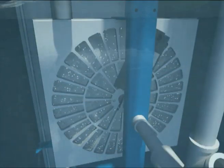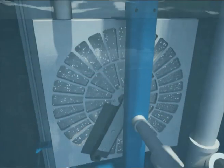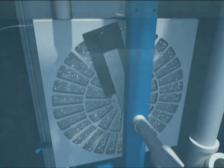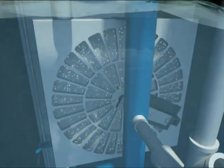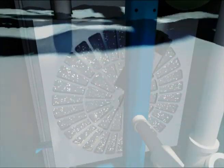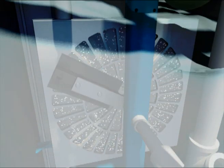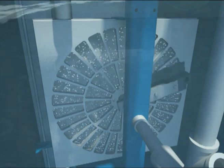When the level reaches a predefined point, the automated backwash cycle begins. During backwash mode, the vacuum pump is activated and a vacuum head rotates across the surface of the disc. The vacuum head suction ports remove the captured solids from the media. Since only a minimal area of the disc filter is cleaned at one time, the backwash cycle does not disrupt the filtration process. The backwash water is returned to the equalization tank for processing.